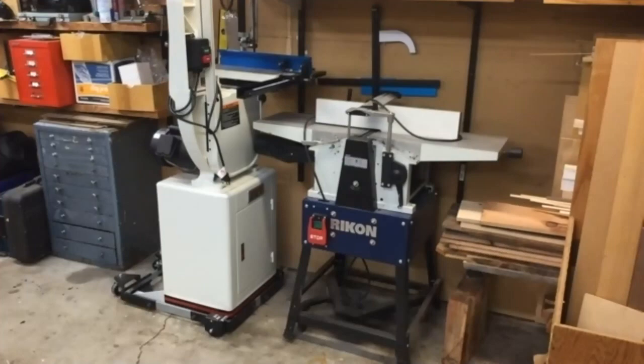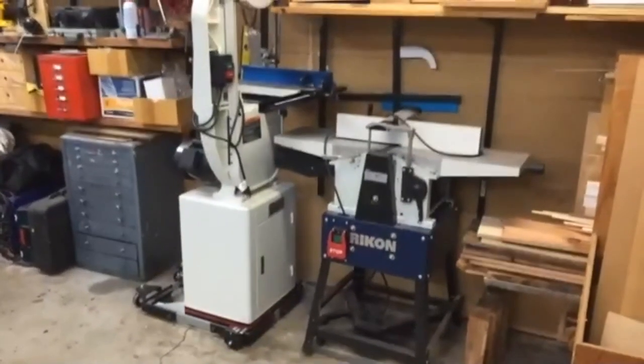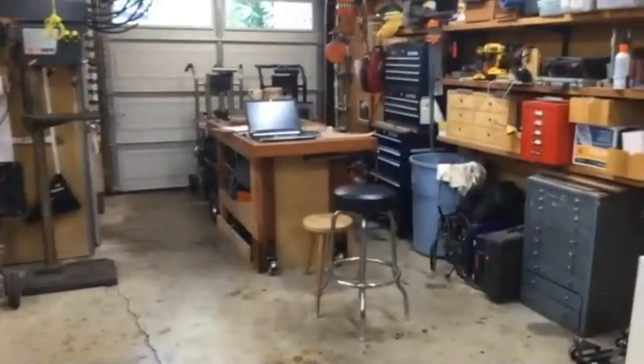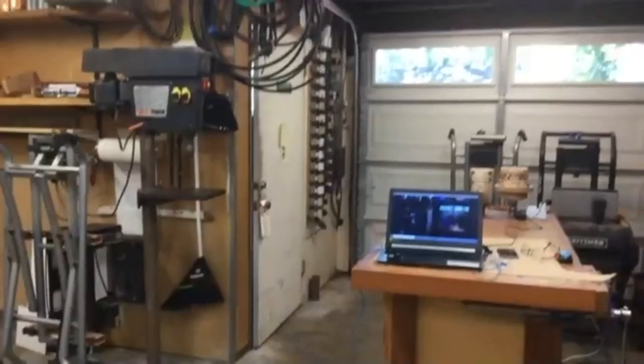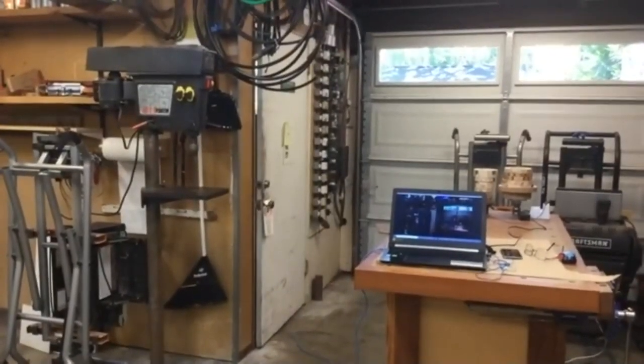I noticed in that alcove, you had a whole bank of electrical, some things plugged into them. What was that all about? Well, I think that's what you're talking about, that wall of switches. I'm on a big lot here in Walnut Creek. I've got over an acre, and it's pretty well all landscaped. So I've got like 24 sprinkler stations. And that's my control system that puts the 24-volt out to the sprinkler system. And it's all controlled off of this Excel spreadsheet to a controller, essentially. And then those controllers are the ones that are plugged into the wall there. And then, as I say, a controller and a transformer for each one of the stations. But you had a whole bunch of chargers for all your power tools. Wow, no, that'd be more power tools than I have for sure.